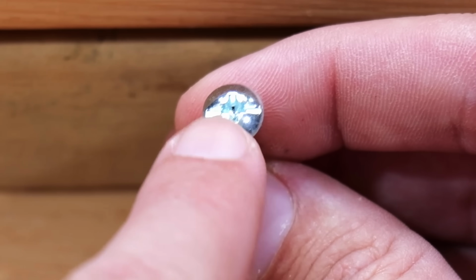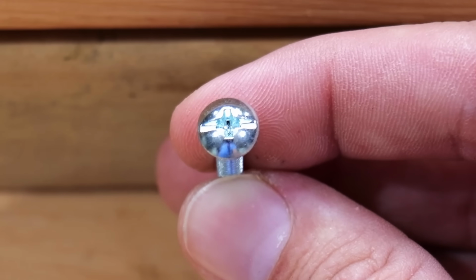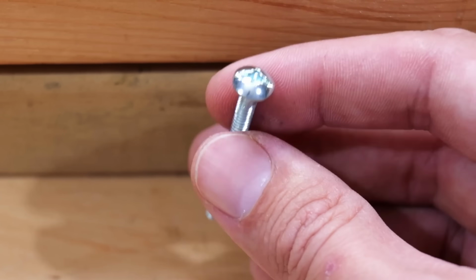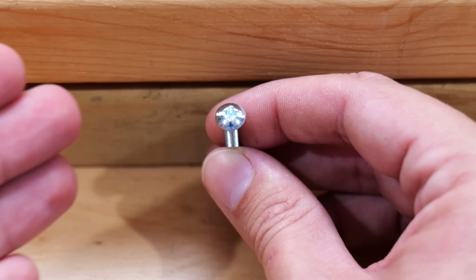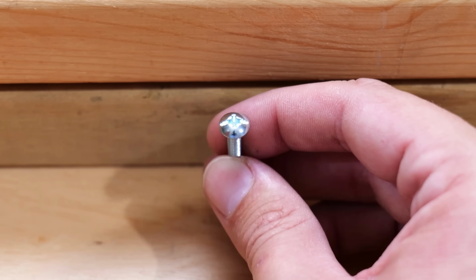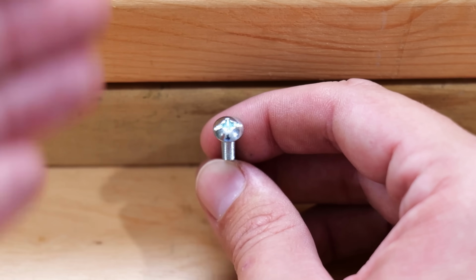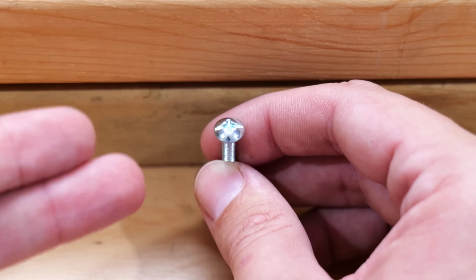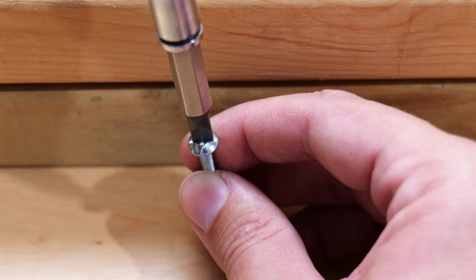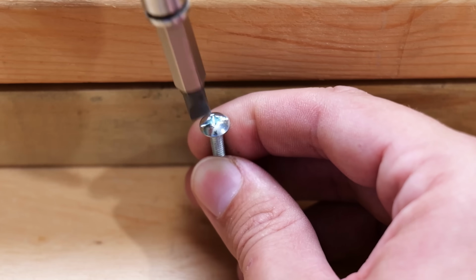But then you have the complete or flat-headed slot that goes all the way across the screw right in the middle there. And this is a bolt and not really a screw, and that's for very good reason. If you were to try and get a slotted screw and drive it into a board or a piece of wood, it would be incredibly frustrating because one of the biggest issues with your flat-headed screws and bolts is that when you put the driver into the top of that screw, it is very easy as you're trying to tighten it down for that driver to just slide out.